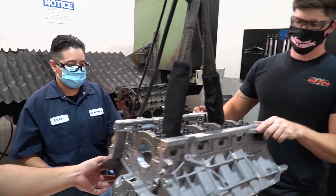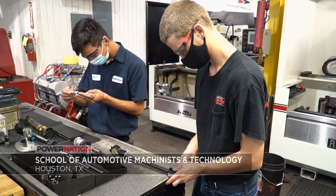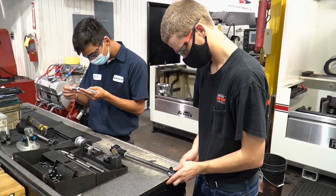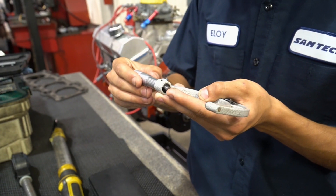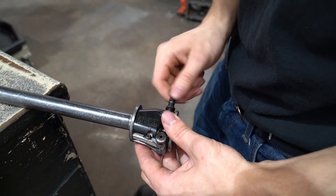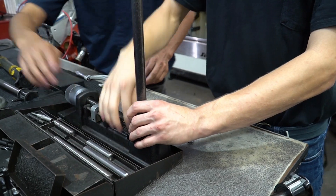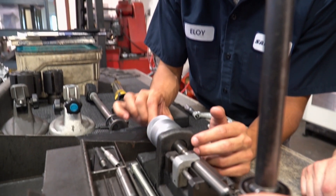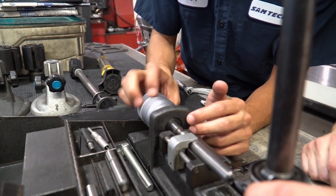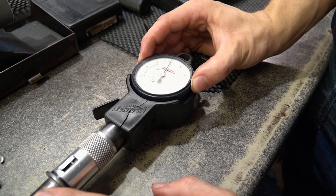Tell me a little bit about setup and the importance of setup — it doesn't matter the operation. That's something we go over very first thing, your first day of orientation here at Samtech, and we go ahead and teach the reading of these instruments. Some people have never picked up a micrometer, some people have never picked up a dialed bore gauge. That's one thing we stress as paramount — being able to correctly set these up and correctly read them. One student should be able to take a measurement and hand that same gauge to the next student and get within a ten-thousandth or two.